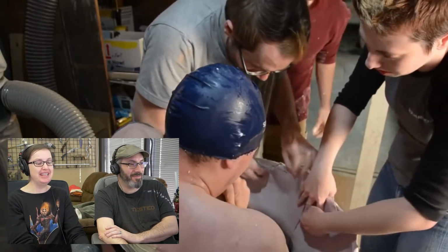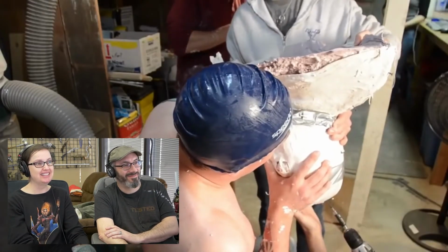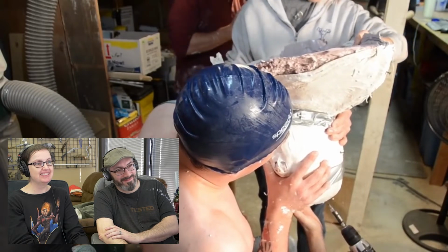To keep it together a little bit more permanently, I liked driving some drywall screws right through that thick seam along the sides of the mold. But make sure the screws don't go all the way into the mold. Then take any type of clay and plug up those nostrils. They were used for breathing before, but now you need them filled up so that the hydrocal does not escape through them. And just like that, you are ready to start casting.